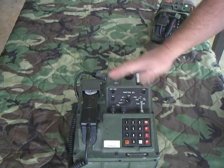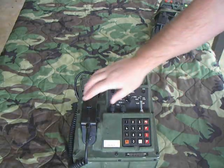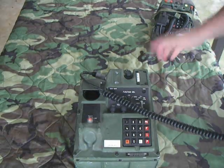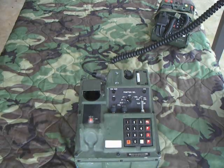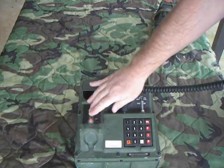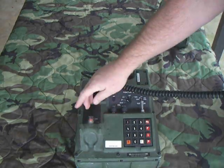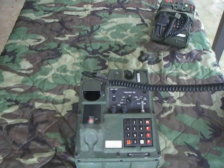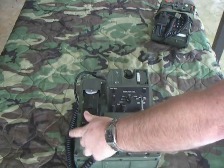If you didn't have the right crypto variable loaded, this phone wouldn't talk to the other phone. If you got an incoming call and picked it up without matching crypto, you'd get a non-secure warning — a heartbeat tone — and this light would flash, meaning the caller is on an unsecure phone. You'd reach over and pop up this switch, and now you could talk to them. That's how you made a non-secure call. Similarly, if you wanted to call someone not on a secure phone, you'd go off-hook, dial the extension, get the non-secure warning tone, pop this switch up to override it, and make the call. When you hung up, it would lock that switch back down automatically.